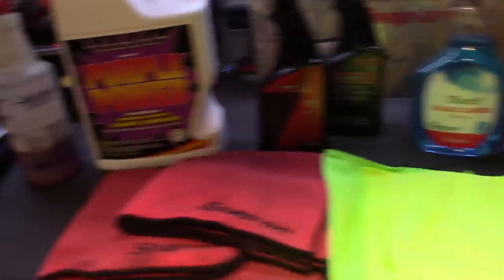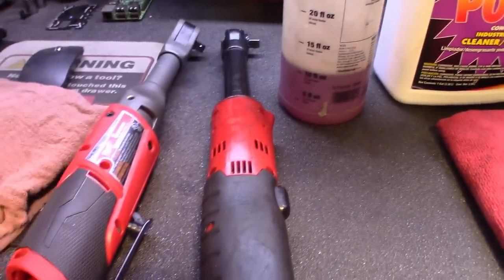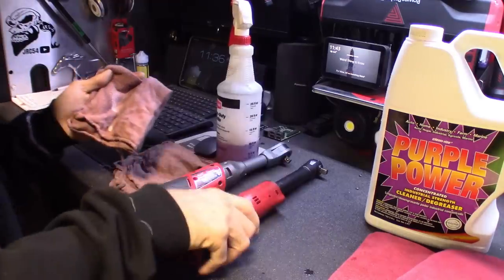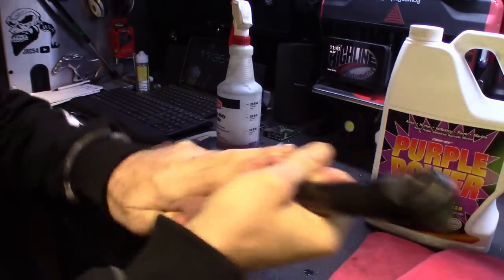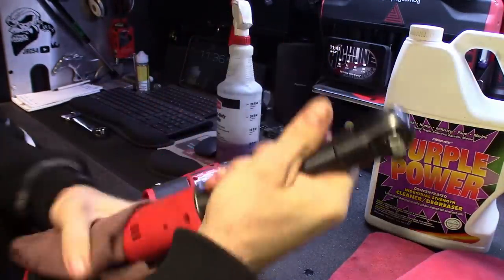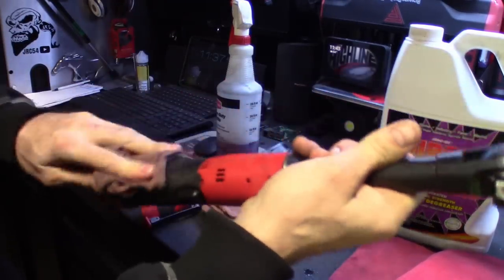Getting to the tool - I'm going to set you guys up on the tripod and clean this one up. It's mostly just oil on there. Sometimes if I forget to do it for a few days it starts to get caked on. Pretty much what I do is take a clean shop rag, spray it with some purple power, saturate it pretty good, and then just wipe it all down. If there's caked on dirt and grime you just scrub at it - it does come off. Then take a dry one and dry it up. You probably don't want to spray it directly into the vents. Just keep it on a clean rag and wipe everything off.